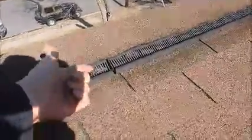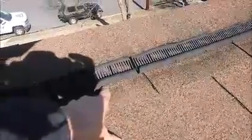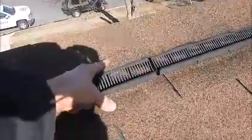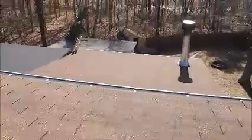So some of that water is seeping into the nail holes, but also when the water gets underneath the ridge vent high enough to where the shingles were cut underneath, the water can go over and then under the shingle, then the water travels down the roof, settles inside the wall, and leaks down to the lower roof.